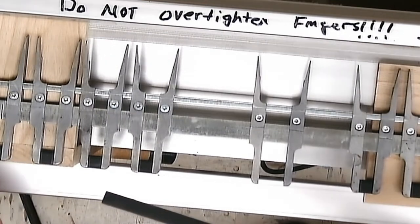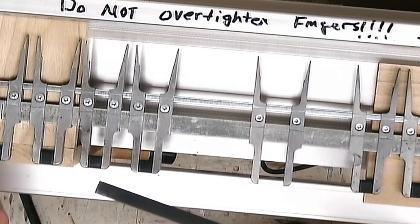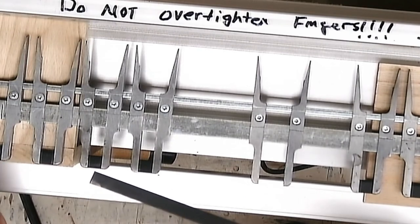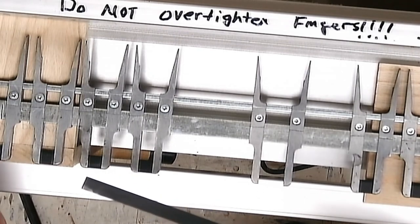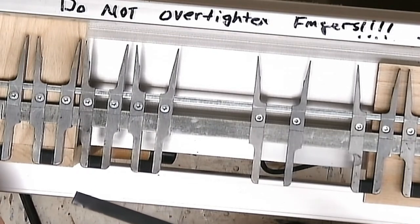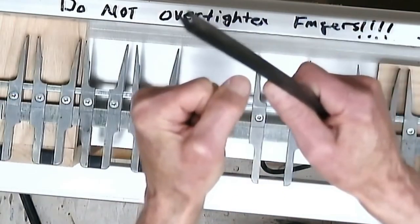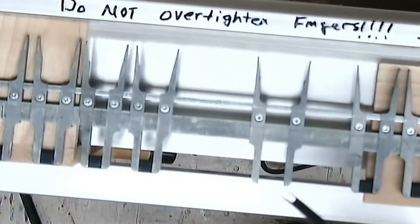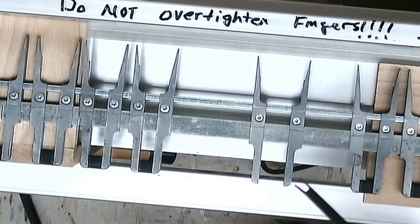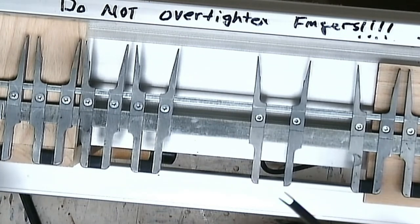if you have a gap between this, we're going to cut a tail right there, okay? And if you have a gap of more than 1/8 inch between the two halves of your tail guide here, then you're going to want to use this extrusion so that as you're routing around this perimeter, your router is not going to fall into the gap between the two halves of the guide finger, okay?